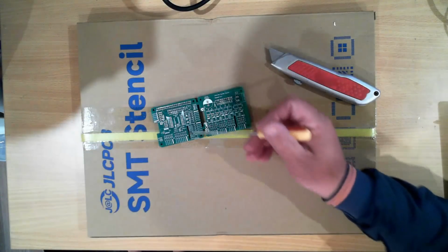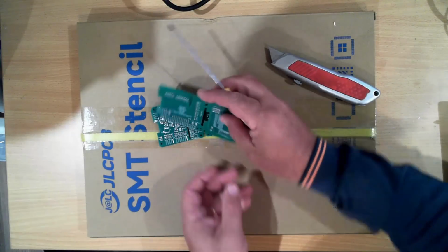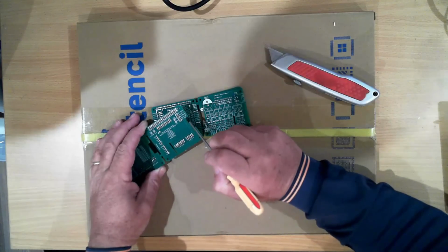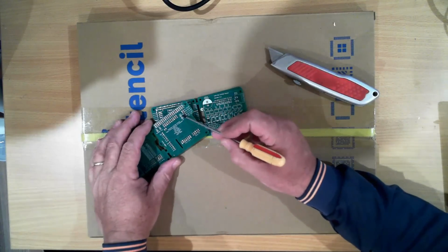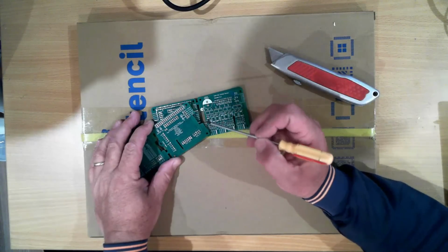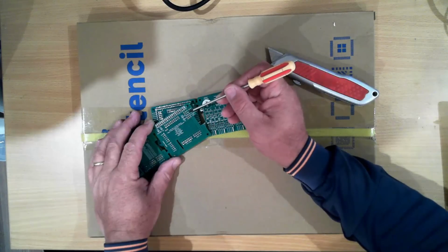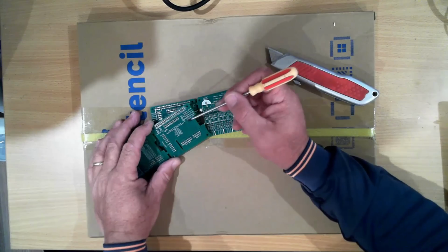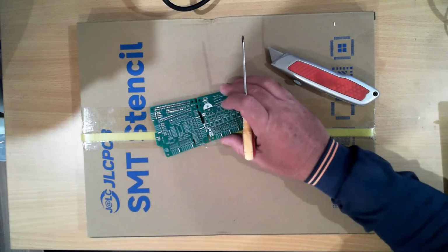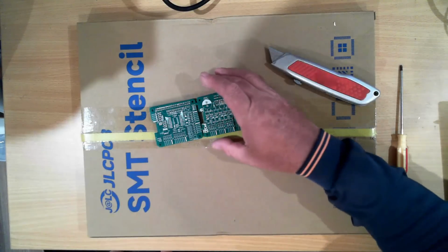The other change I made is I added an extra pair of pins here. So now, if I flip this over, we have 2 grounds and we have 5 volt and 3.3 volt. On the original design I only had 1 ground and the 5 volt. I added the 3.3 volt because the I2S is all 3.3 volt based. The I2C, that is the SCL, the SDA, ground and 5 volt, because on this side of the board I actually have transistors and resistors set up to do a level shift, but the I2S didn't have the 3.3 volt available. So now that's done.